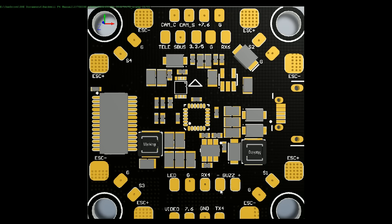Another thing is that it's not the best if you want to use Crossfire. Crossfire requires both a transmit and receive pad on the same UART. All the shuffling I did to give you all the functions with as few pads as possible means there's only one UART available that could do Crossfire. You can do Crossfire — you'll need to use pins RX4 and TX4 — but they're not right next to each other, and the 5 volts going to the receiver will be coming all the way across the board. Does it really matter? No. But it could be better. As we look at changes going forward, we might try to better accommodate Crossfire users, but today you can use the board with Crossfire — your wiring is just going to be a little bit messy.